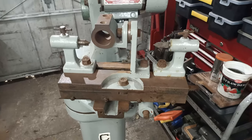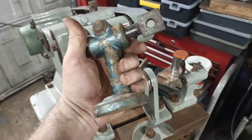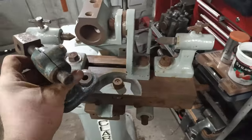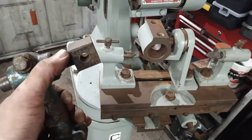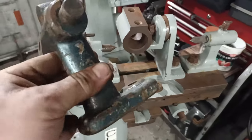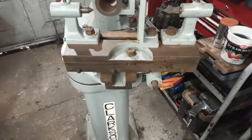I also grabbed this at the same time — I saw it in a pile of junk and I think it might be the dresser that belongs to this machine. It's of a similar design, and I believe it's used to dress the wheel: through this hole here you mount a diamond-tip work piece and use that to dress the wheel. It looks period-correct and about the right type.